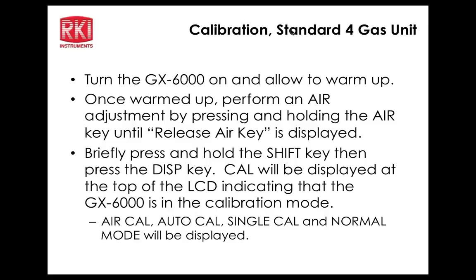If I can make a comment on the low-range sensor, we really need to let them know it's 1 part per billion to 50 parts per million. They look at it as 0 to 50. It really doesn't tell them that it is a parts per billion one. Well, it actually reads out in parts per billion, not parts per million. Right, 0 to 50,000 ppb. Yeah, but we need to let them know that because it'll bring their attention to the fact that low-range sensor is parts per billion. Good point. Really, a lot of people don't. Also, on the parts per million, when we say up to 6,000, we need to let them know that it starts at 0.1 part per million to 6,000. We get asked that all the time: in what increments does it start? 0.1.